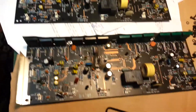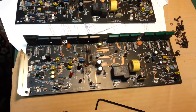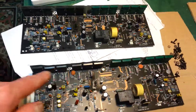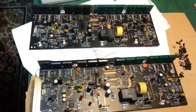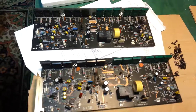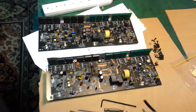I've got a few tricks about powering it up — basically you power it up without the output circuitry hooked up by lifting the collector lead. That way you can check the driver circuitry, and if there's an issue it doesn't take out all the output transistors, because there are a lot of them.